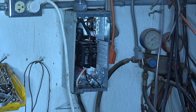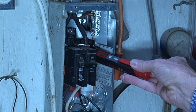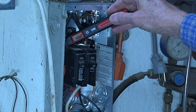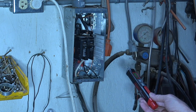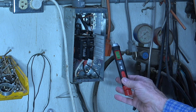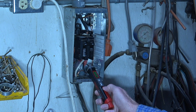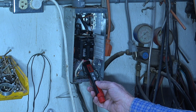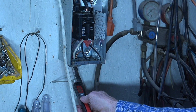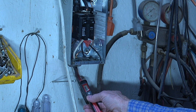If I wanted to check a box like this, I'm going to go in here where the power is coming in — now you see it's screaming bloody murder, goes up to 100%. The other side does the same because this is a 240-volt box. Occasionally they'll show something on the outlet and this shows a little bit, but I don't know why it does that — it is dead, I've checked it with a meter. If I turn this on, it's going to go nuts again, goes up to 100%. That one is showing 99% right there.